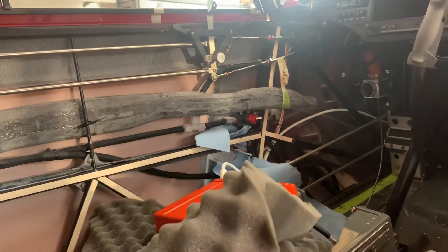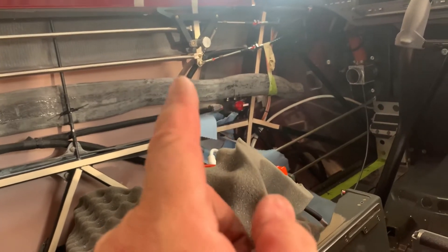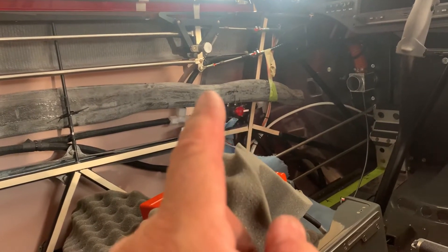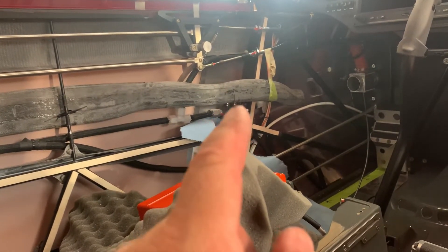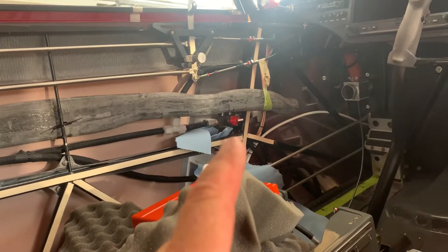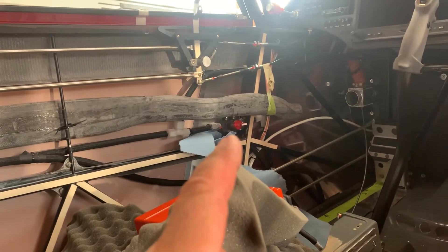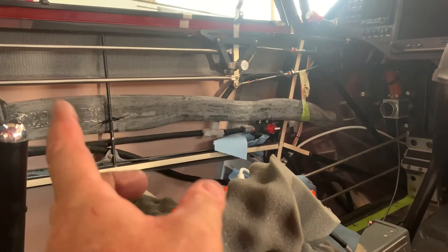I'm going to leave this here to double-check it. When I got this fuel selector, they sit on the shelf a lot of times, and those O-rings will dry out. It's best to open those up, clean the O-rings, or just replace them with new O-rings and put O-ring sealer grease on them. I've got another post on the forum that shows how to do that — how to change those O-rings out. You have to be careful with the little springs and little balls in there. Put everything into a bag when you remove it so those springs and balls don't fly off.